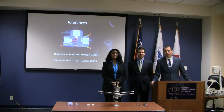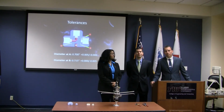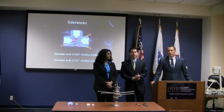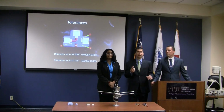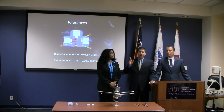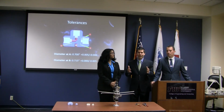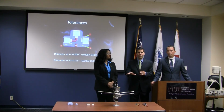Another question is about degrees of freedom. You're launching this at 75 degrees to the horizon, and the only thing you're doing is rotating it in space. It's hard for me to see how. It gets a little more complex because when they launch it, it's going to spin at 4 hertz, because of the way the fins are, for stability, so it's spin stabilized. Then before the pitch maneuver, they're still going back and forth to see if they can have a system that can pitch it while it's spinning, which this will be able to.